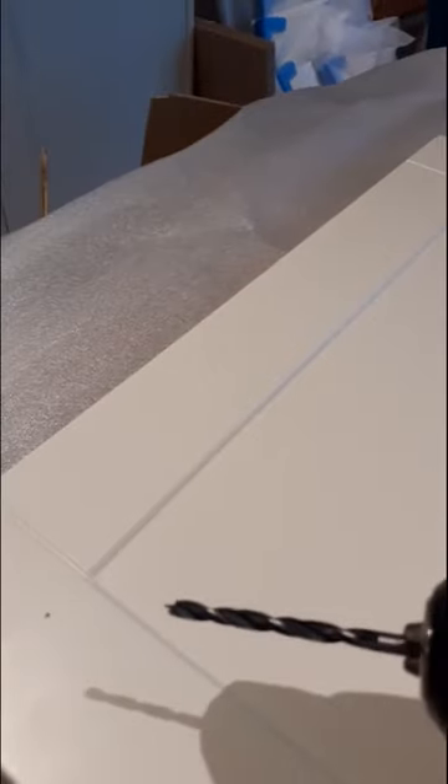I'm going to drill using my 4mm drill bit, the holes all the way through. Probably not advisable to do it on your kitchen worktop but I am going to - just make sure you have a clearance gap so you're not going to drill through your worktop. These are the holes drilled here and as you can see underneath, a little bit of the covering has come off. This is why it's best to drill through from the outside, and the screws will just fit nicely through there when I'm ready to put my handle on.